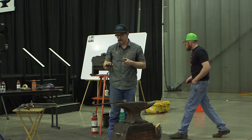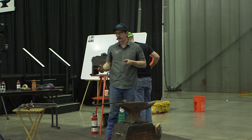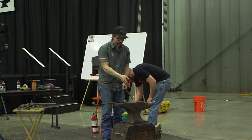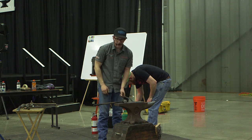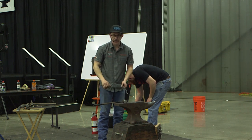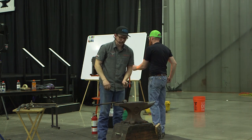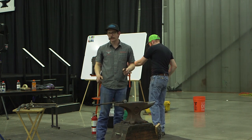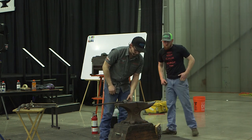If you have a pair of shoemaker tongs and the jaw's crooked to the reins, then you don't know square. You're always relying on just looking at your stock. But if everything's square on the jaws, your hand knows square really well. It can just feel it. You just have to trust your gut. But if you have a pair of tongs that are a little twisted, you're going to stop trusting your gut really quickly.